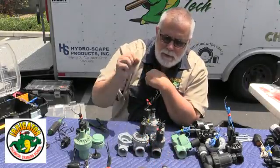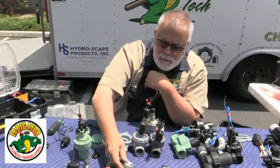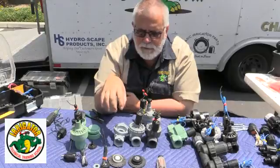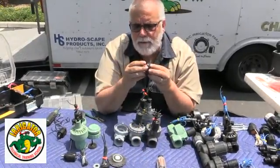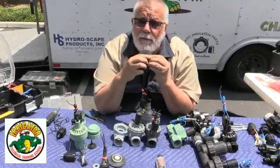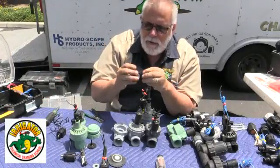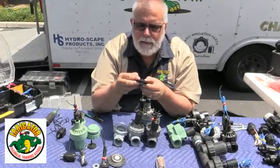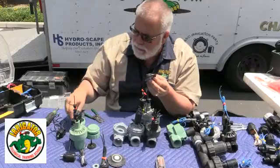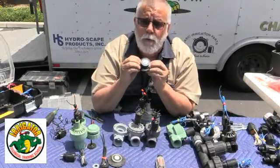A nice thing to know is that you can get an Irritrol diaphragm, or a HIT diaphragm, or an Orbit anti-siphon diaphragm, and they're all interchangeable. The seats will work on each one — may look a little different, but they're interchangeable. You may want to try that in a fix to make sure you're testing your valve. If you've got an Irritrol or any of these valves, unscrew it, and if you've got a ding from a rock inside here, just flip the seat, stick it back in, and now you don't have a rock and a ding in it. You can do it only one time. Make sure you use O-ring lube, put it around it, seal it, and set it back on. If you open it up and the diaphragm's fine but you need a new seat because a rock hit it and put a big ding inside, just unscrew it, take the seat out with a little screwdriver, pop it right out, flip it upside down, stick it in, and you've got another couple years of wear and tear on the diaphragm.